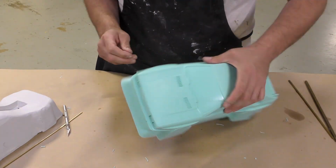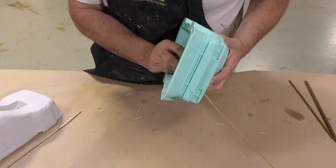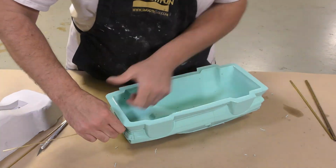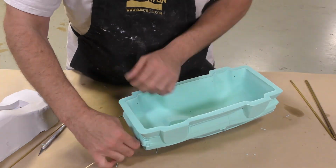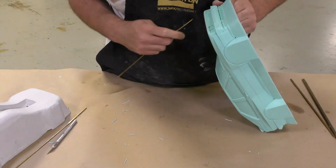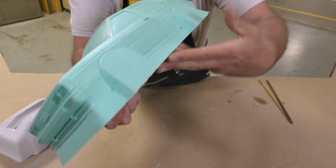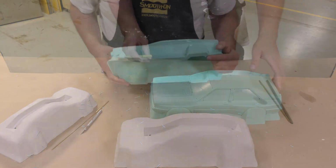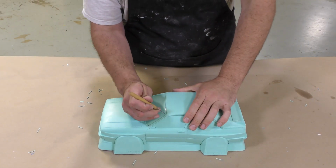These air holes are punched in very specific places where we want the detail of our model to show up in the vacuum forming that we're going to be doing. So any detail, any corners here are going to be punched with a hole, including the lights and any kind of recesses. So you can see here in the lights and the corners, I have punched holes all around. Now with a sharp tool, I'm going to mark the form underneath, the freeform air shell that we created.